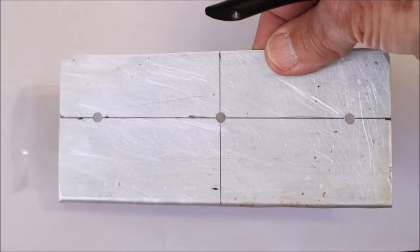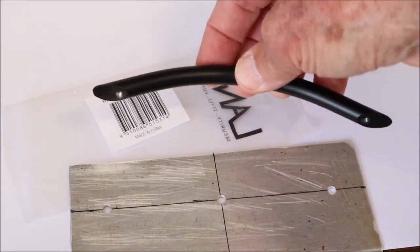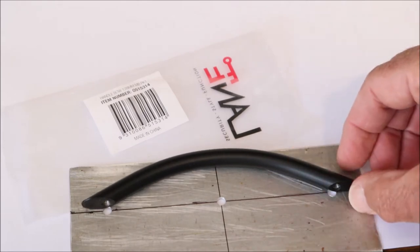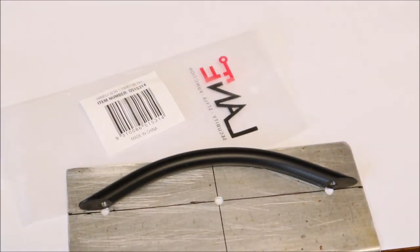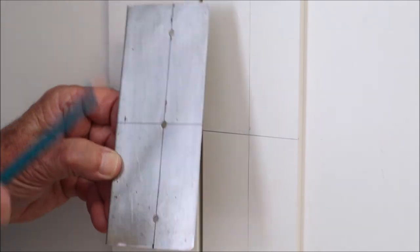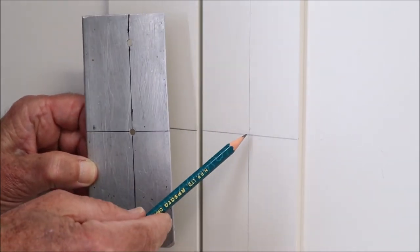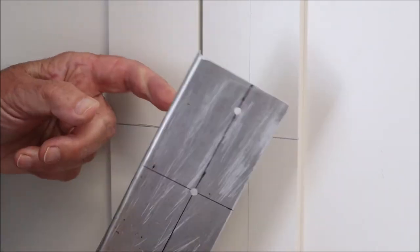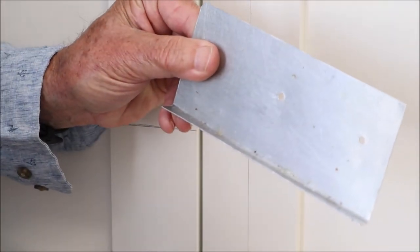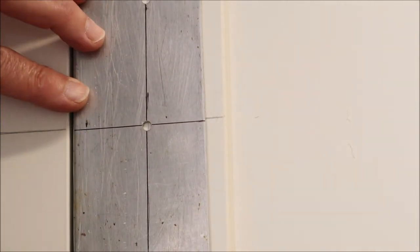It's always a good idea to check before you drill holes in your cabinet that the holes you've drilled line up with the holes in the handles — and that looks good. Now with your template made, all you have to do is have that center line lined up with the line on the door and the lip on your template lined up with the edge of the door. Once you've got those two things lined up, the rest is automatic.